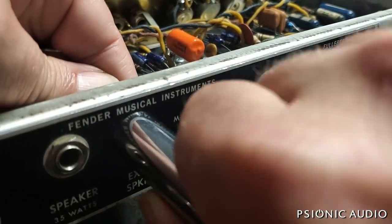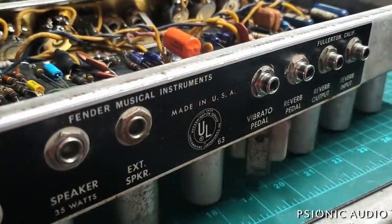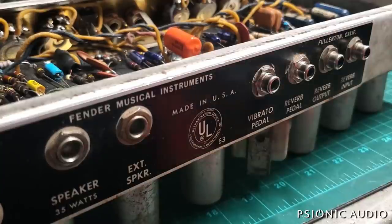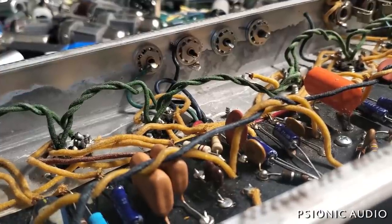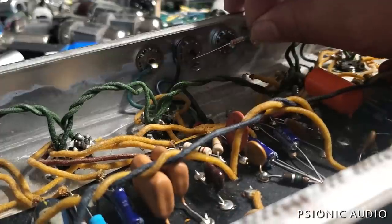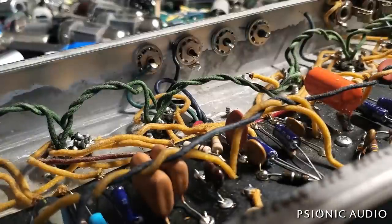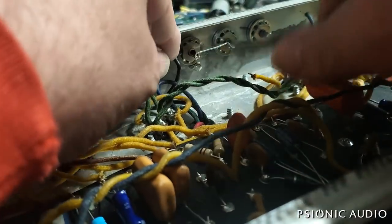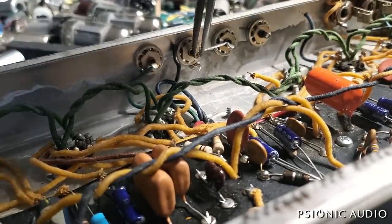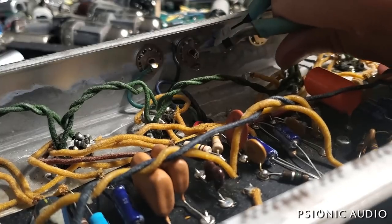The front panel nuts on all the pots were quite loose, so I suspected I'd need to check these as well. A very common issue with these amps: the leads on the old resistors they used are much longer than the leads on newer resistors, so the new one won't really span the connection by itself. I'll get a little bit of bus wire, which is our friend. This will actually be better built than the original, but it takes longer because I don't have the extra length of that old resistor lead.